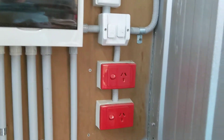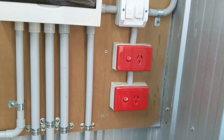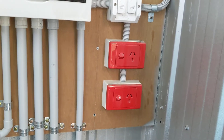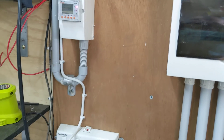We've put red power points on all the UPS circuits — that's an Australian standard. The red power point dictates that it's a UPS circuit. White is standard. There's also other colours; I can't remember what they're for, but there's a green and something else — blue, I think.